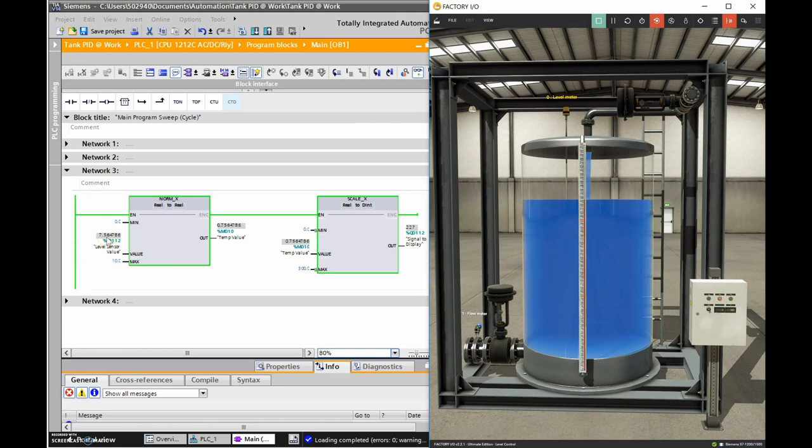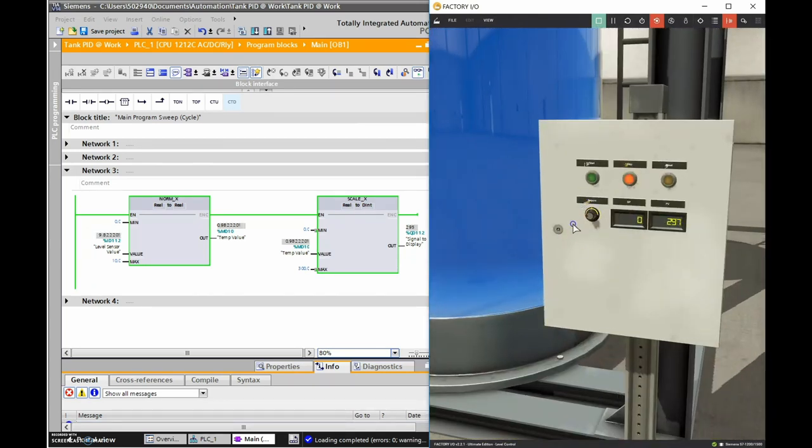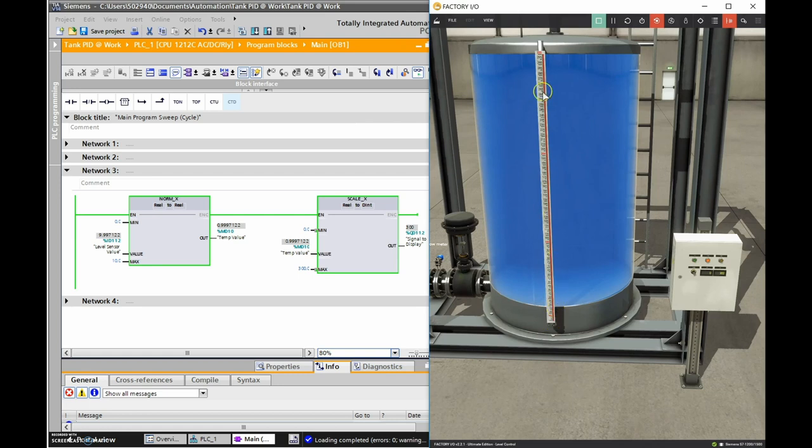We should be able to go all the way up to 300 - you can see the voltage increasing, getting close to 10 volts max. We've got 299-300 now, showing 9.97 to 9.99 volts out of 0 to 10, giving 99.99% of 0 to 300, equaling 300 centimeters in the tank. Scrolling out - a full tank going from 0 to 300.